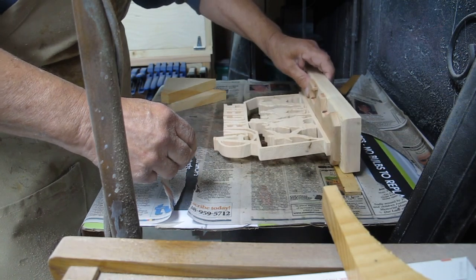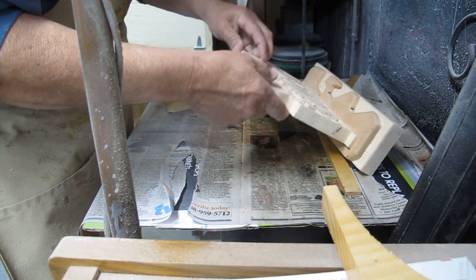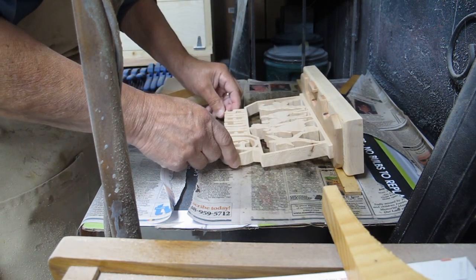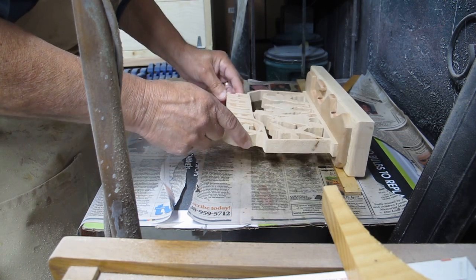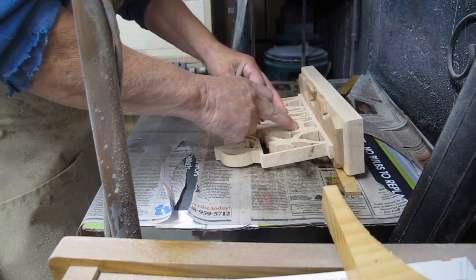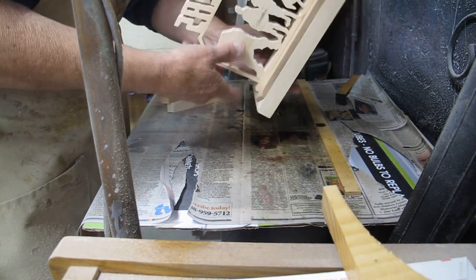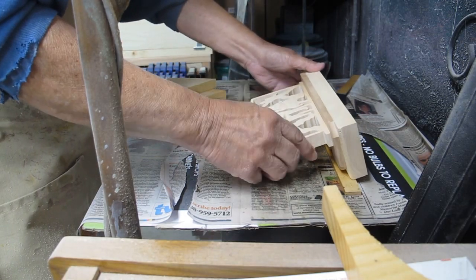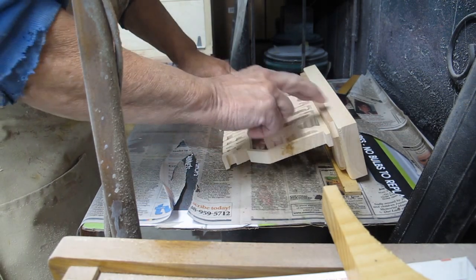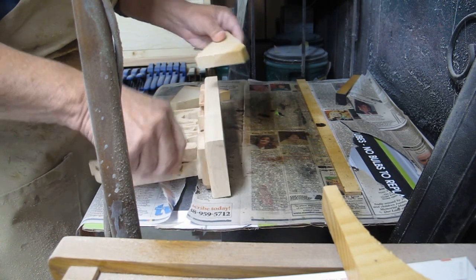However, when you lay the sign down, you still got a problem, because if the base is a little higher than the actual sign placement, you're still going to have a bit of an angle here with the sign laying down like that. And if you spray it, still some of the spray could drip down and leave you with ripples on there. Especially if you do like the back, for example, it would be, again, very difficult to keep that from dripping down. So what I did was I came up with these little wedges.